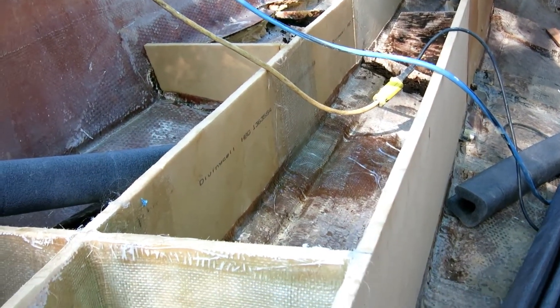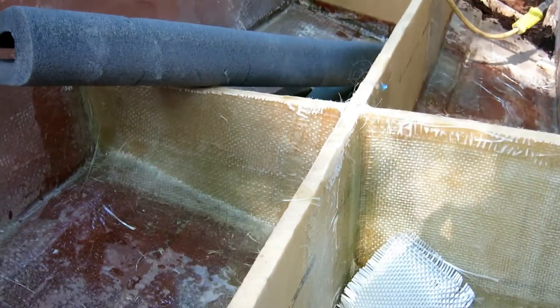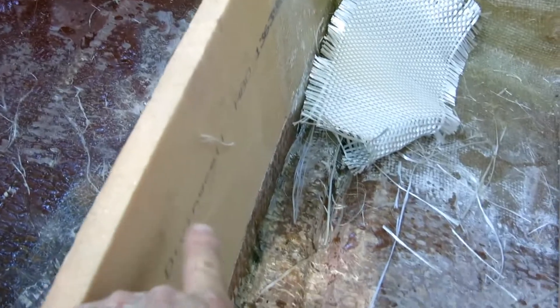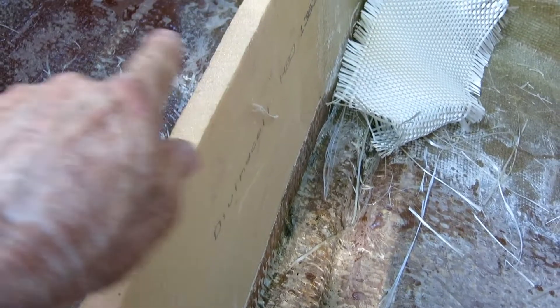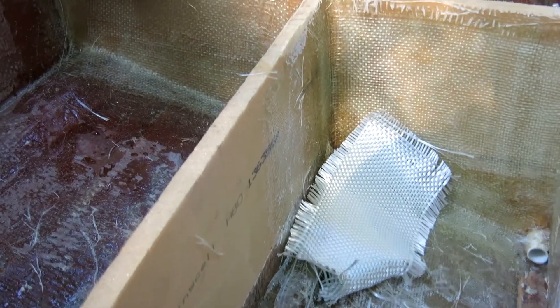So I'm going to put it back a little stronger. On this outside stringer where I saved the glass, I put another layer of chop mat and another layer of 19-ounce woven on top of that. And when we get finished, I'm going to put two layers or more of bi-axial combo mat across the top.